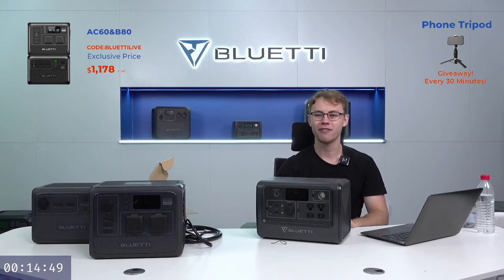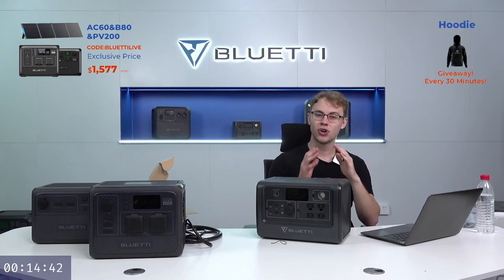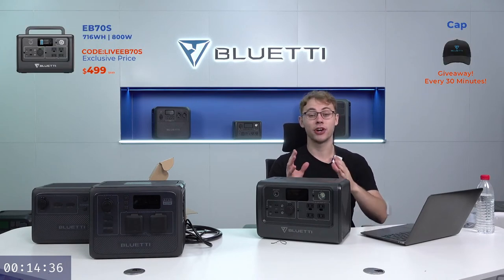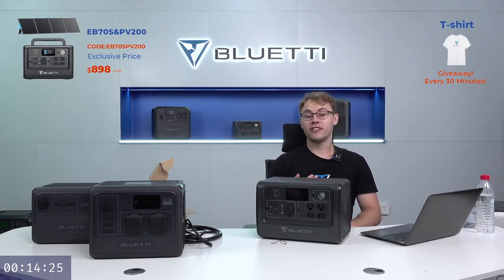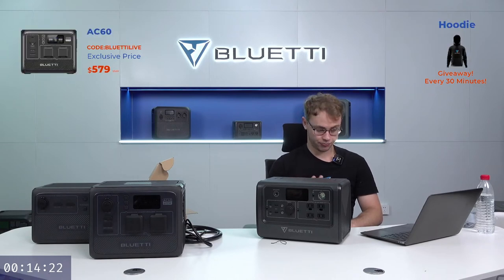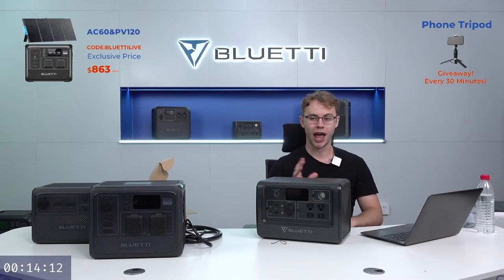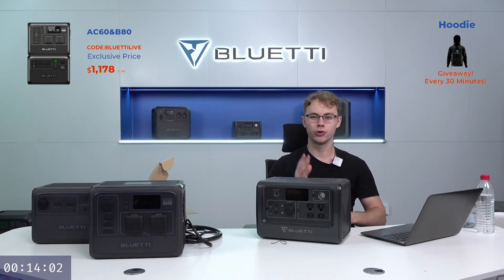And realistically, we don't have that many sunny hours a day, right? So I recommend you guys go for something like PV200 with the maximum input of 200 watts. And don't worry, you will not get 200 watts, so you don't have to worry about wasting the potential because you're thinking, oh, 200 watts maximum in PV200. Well, 200 watts is the ideal, it's like the maximum input you can get from this panel. So realistically, it will get around 180 watts. And it will take you 4.5 hours to recharge to 100%, and only 3.2 hours to recharge to 80%. Okay? So get something like the PV200 portable solar panel for your EB70S.